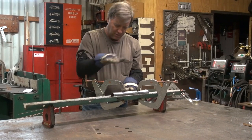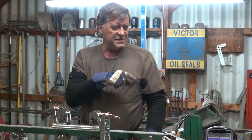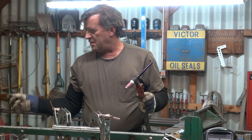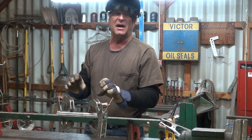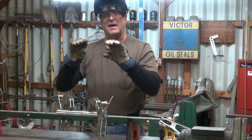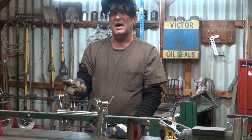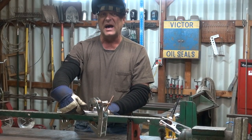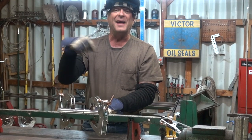There's still a little bit left over where I can go in and just grind it down — hit it with a grinder to even it out, smooth it out, and it'll look like nothing's there. I'm running some 1/16 E3 tungsten sharpened down to just about a point, and some 1/16 filler rod because it's such a tiny little joint. Now, I've got to clamp down on both sides. I'll come in on both sides of the pipe and get a little tack. Not only is my pipe held down by the clamps, it's also held in place by the angle itself. If I put a tack on top and then try to roll it over to get the other side, I'll get a little bow. So tack it on both sides first, then a little tack at the top — do the sides first. Roll it over real quick and get a tack on the other side, so you've got it on all four corners and then you can go ahead and weld.